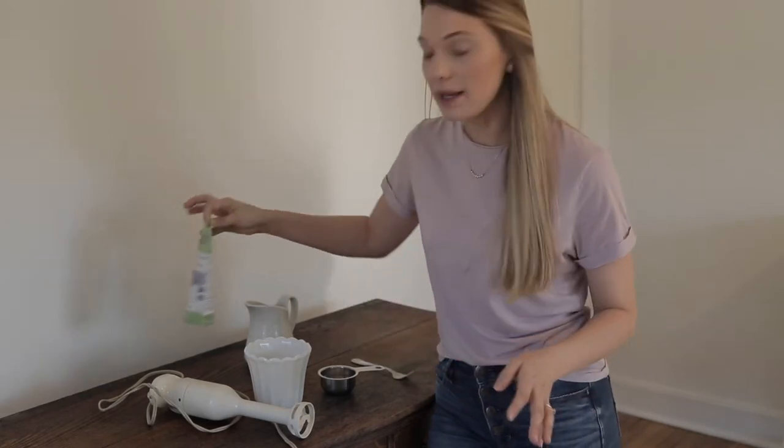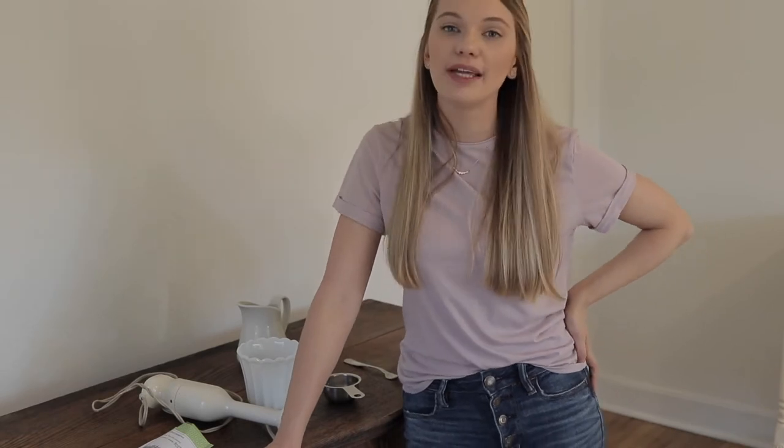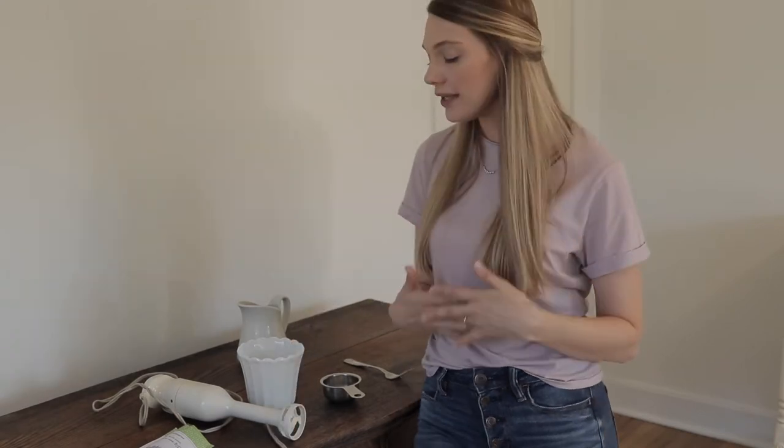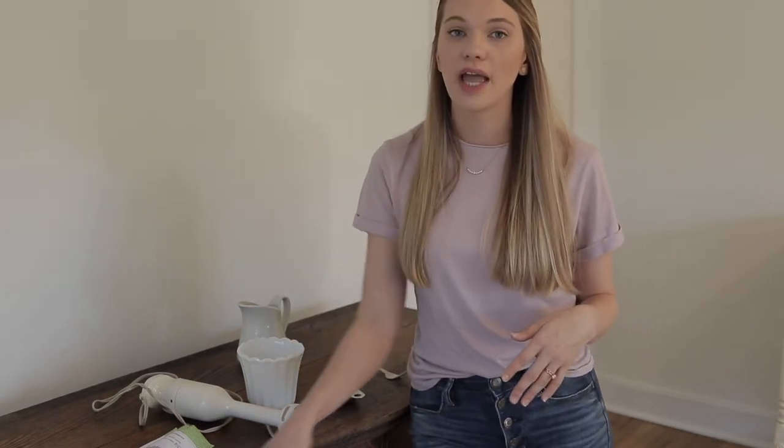So we need to go ahead and mix it up, and I like to only mix up the milk paint that I'm going to use for my particular project. And I only mix up enough for one coat. The reason you want to mix up milk paint in small batches is because milk paint does not contain the same additives as traditional modern paints. And therefore, after a couple of hours of being mixed up, the paint will start to gel up and be basically unusable. You can delay this by putting it in the fridge, but I personally just find that even in the fridge, once it comes out, it can still be hard and kind of gel up. So I just mix up what I'm going to use for one coat of my piece. And I would rather err on the side of needing to mix more paint than mixing too much, because then I might waste the paint.